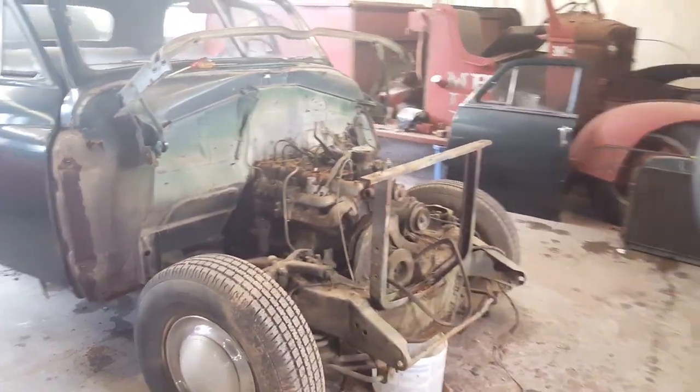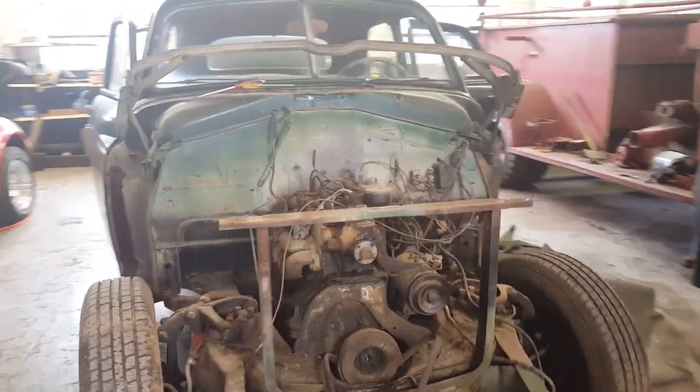Details. I think the first thing though I need to do is go back to my office and start looking for parts, because we're going to need a steering box, we're going to need all the brakes, all the suspension components. And as of right now, the rear brakes are locked. I can't get the car rolling. So we're going to have to do something. So you have to look for brake hubs, brake shoes, and hardware, because I guarantee it's probably rotted out inside.